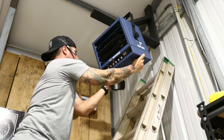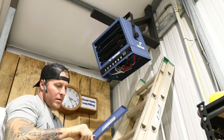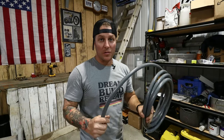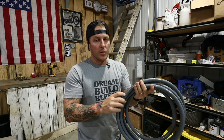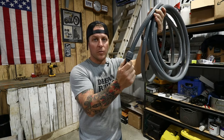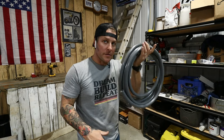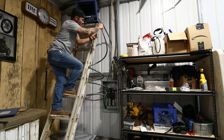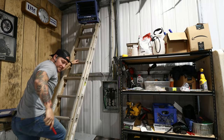We have our wiring instructions right there inside the unit, which is pretty cool. Change of plans — I found some liquid tight in my electrical bin so I'm going to run the wiring in that all the way to the heater. It's a little more costly to buy but it's really good stuff. A lot of people don't run it interior and I wouldn't either, but I have it. This piece will fit right into our breaker box and I can run the liquid tight all the way to the shop heater. It'll be a little overkill, but it's free.